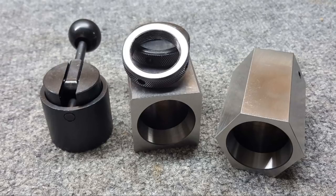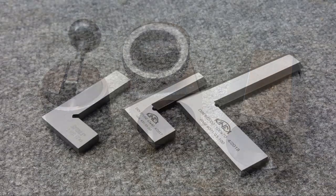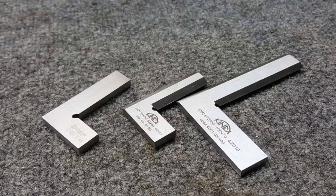Now I've got all this going on and I'm looking for more precise stuff — I want better things in the shop. I accidentally stumble across precision squares, and they are fantastic. Now I'm on a granite plate figuring out how to test and measure how square they are. These things were insane — the one in the middle, I couldn't measure any error in it at all.